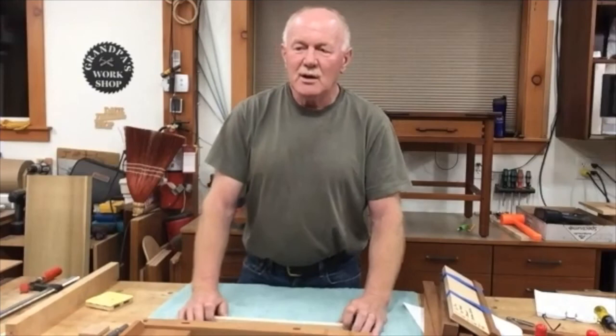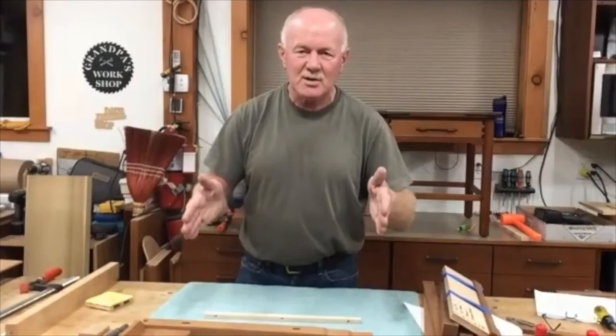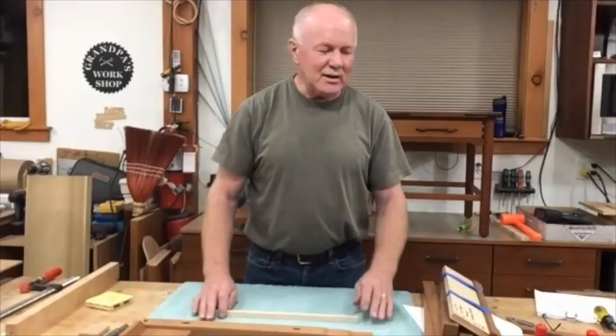All of his case pieces have wood runners except the big pedestal desk, and in that case, the bottom drawer, which has hanging files and a buttload of weight, because this is holding file folders and a lot of paper, and access to the back is important. So there we use AccuRide full extension drawer glides. The issue you run into with going to metal glides is where do you mount the hardware, the glide itself, and keep the drawer front looking like this drawer front. Yeah, that's true.